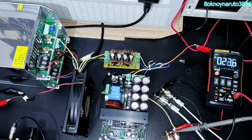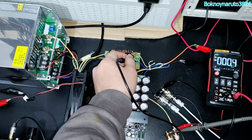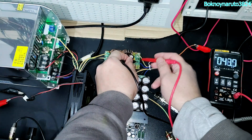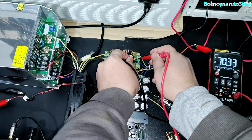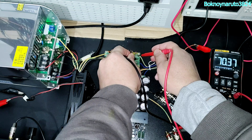To satisfy our curiosity, we're going to test this amplifier again at 2 ohms load but at a bit lower supply voltage. This time we're going to test it with a dual 70 volts power supply. Last time we tested it at 80 volts. I'm just going to show that the power supply has been set to 70 volts — 70 volts on the positive rail and 70 volts on the negative rail.